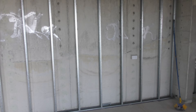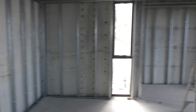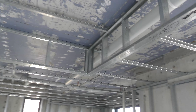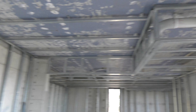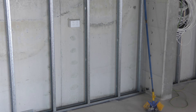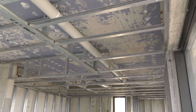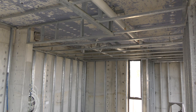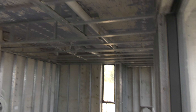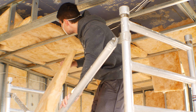What we're doing with this studio is putting a steel frame in front of the concrete walls, because the walls are actually bowed out a little bit. If we did stick-ons, it would be very hard to even out the gyprock — in the US you'd call it sheetrock. You can see the power points we need to remove and bring down about 300mm for desk level. We've also got pipes running through here that I want to wrap with sound deadening, so water sounds don't bleed into recordings. Behind those frames we're installing thermal insulation — our 1.5, 75mm thick thermal insulation from Bradford.